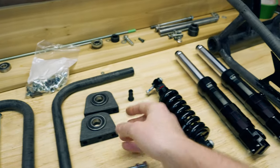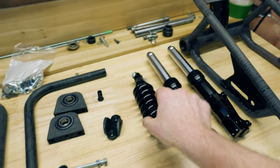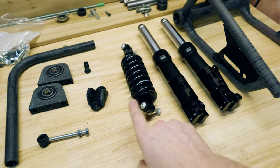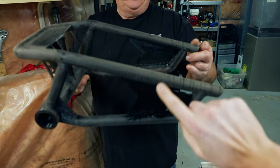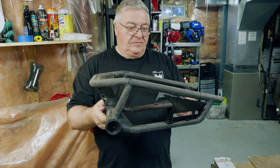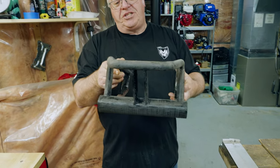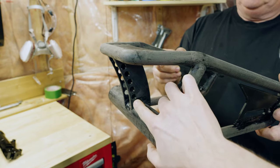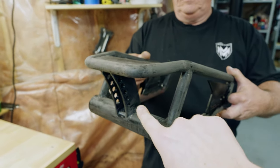These also adjust. We bought a shock here to test out — this is rated for 2,000 pounds, which my dad thinks is overkill, but I'd rather have something a little more stiff to try and then go down from there. We've got our front forks and our 3D printed swing arm. You can basically put the shock in any one of these holes and change how stiff or how soft the actual ride is.